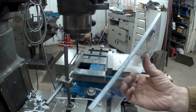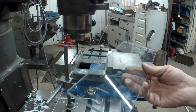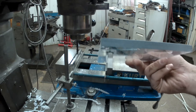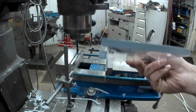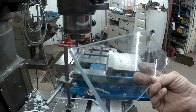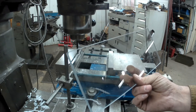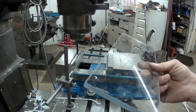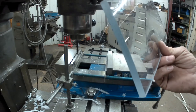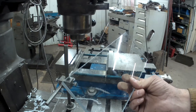We've just cut these backer pieces out of our 3/8-inch Lexan. This is left over from the windows of the Mark Twain Zephyr, so we're using it as the backer piece and mounting plate to the car body. This will give us our electrical barrier to the stainless steel. Now let's drill the holes for the mounting brackets and then the mounting holes to screw this to our actual bus bar.